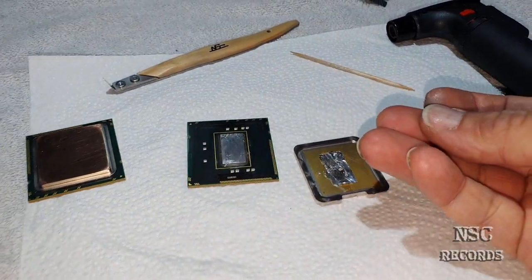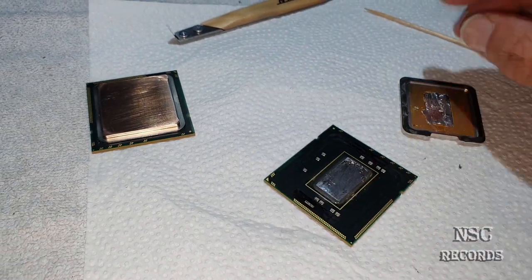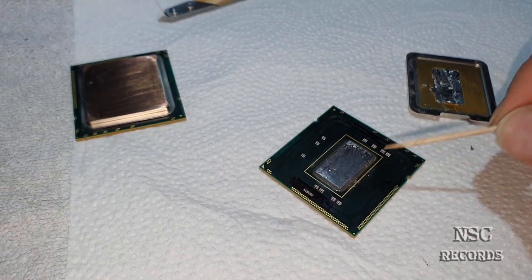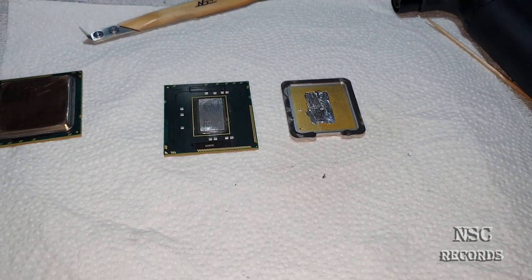Be sure that you have no soldering rests or, let's say, dirt somewhere over here, because it could get in contact with these SMD components here, and then you're gonna have a short circuit. So just take care, you should always watch out and work clean.